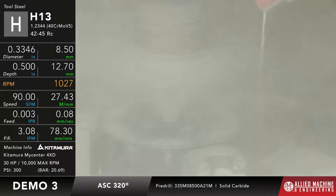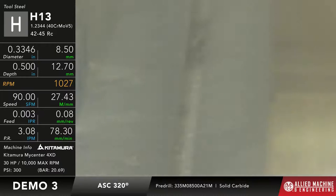And then we'll do the same thing with this one that we did with that 3H24. We're going to go and gauge the hole. Now this one should already be comp, so I should be able to make a good thread the first time, because we've already shown you how that cutter comp works. And we'll double check that and see how that goes. So Dave's got to switch his program around here real quick. While he's doing that, I'm going to tell you what we're going to do with the thread mill.